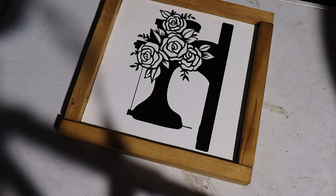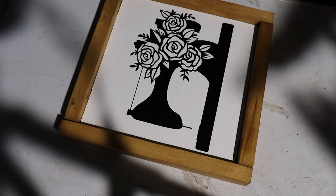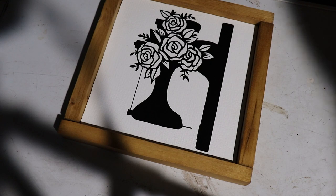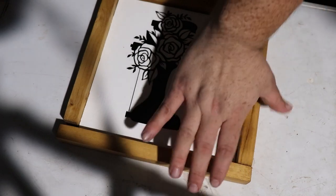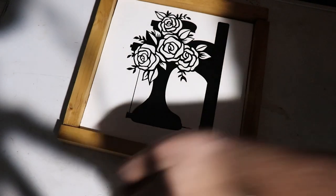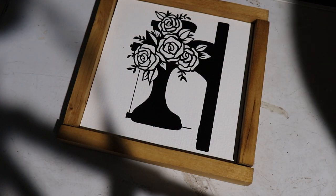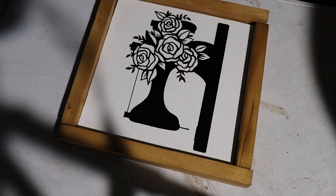Alright guys, so after you touch it up, you let that paint dry, bring it outside. I'm going to use a pin nailer. So it shoots out 18 gauge nails, and I believe they're 1¼ inches. Gotta double check. But I'm just going to go ahead and connect pieces of the frame together. So, 2 nails here, 2 nails here, and then I'll go around putting 2 nails on each side. Honestly, 1 nail per side going into the picture frame would be enough.